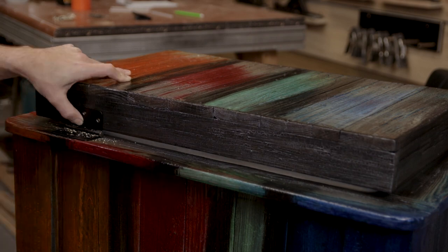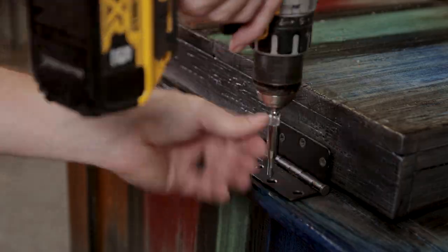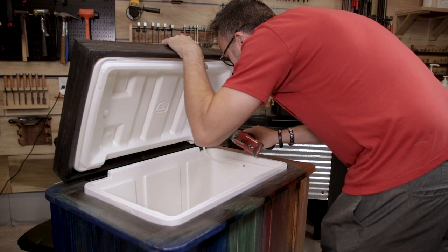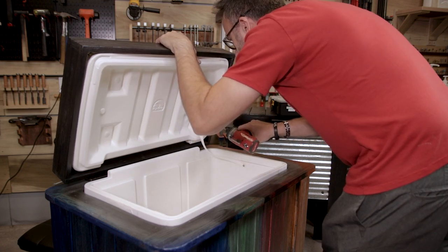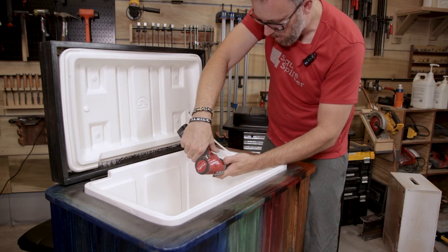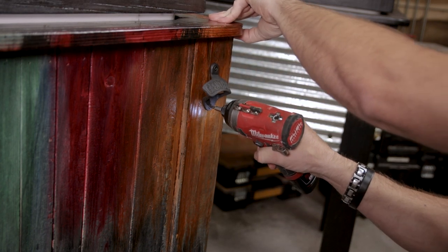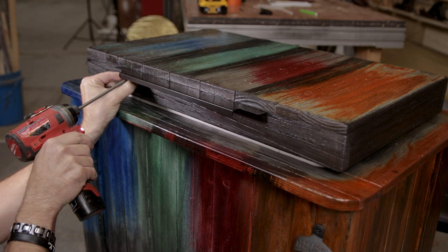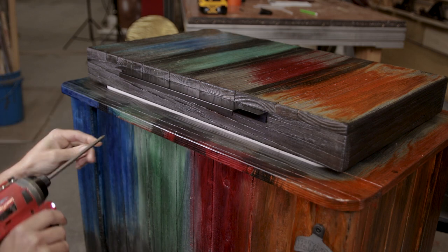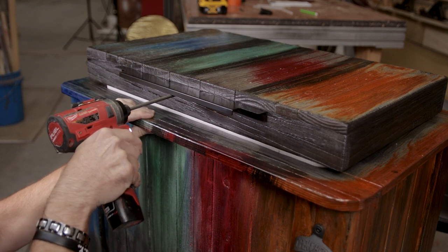For just a few finishing touches: if you have all the coats of finish you want on here, we can put on our hinges — I use just simple door hinges on the back — and then attach our lid. The lid stops the wood from contacting the top plate at the back. I still like to reuse the plastic strap for double reinforcement. You do have to re-drill the hole just to lower the strap a bit. Then you can choose any handle you want — a simple gate handle works really well and they're very cheap. I just happen to have this aluminum Ikea handle that I painted black. And that's it, we're done.